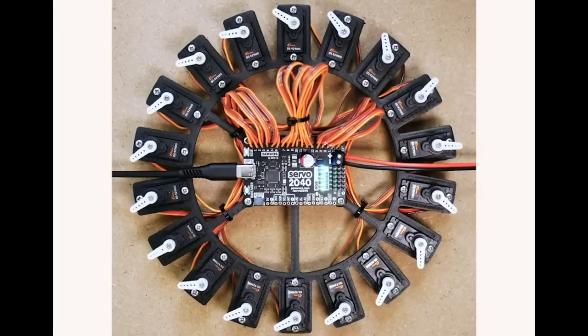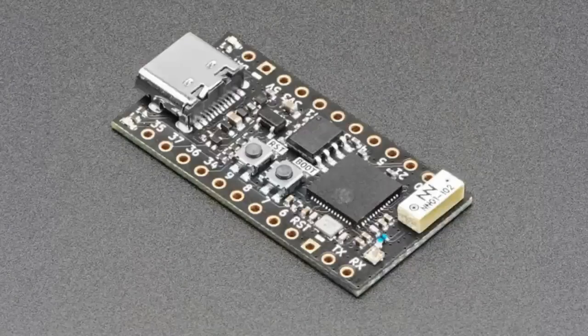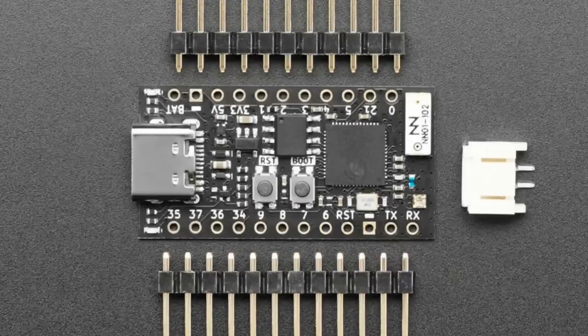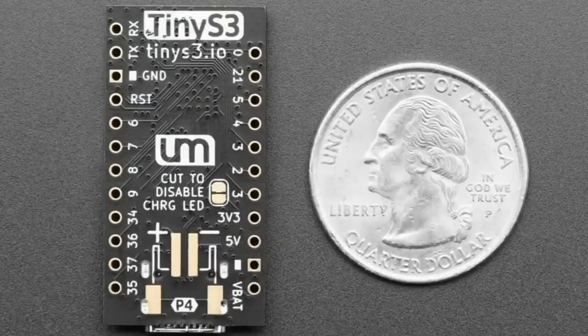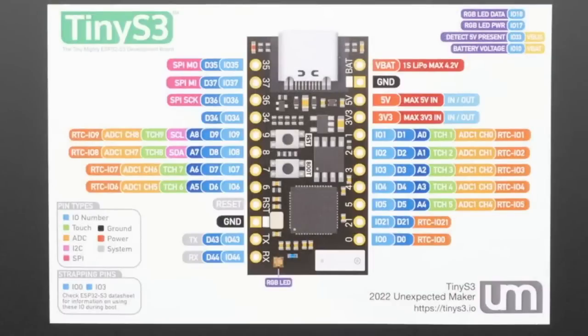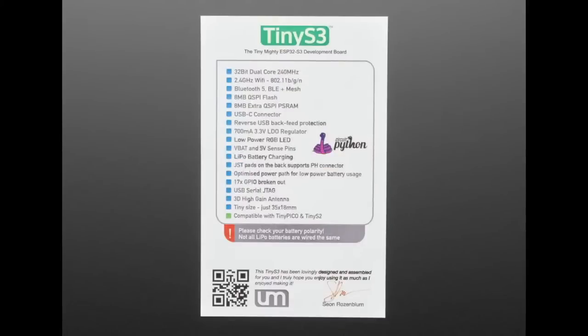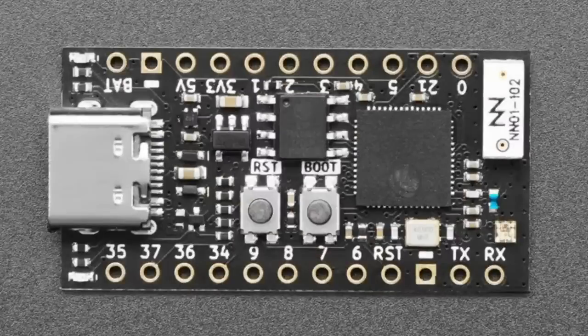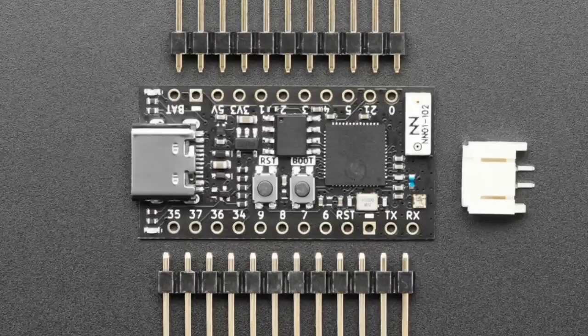Okay, and then starting the Unexpected Maker tour, here we go. Yes, we've got 3 ESP32-S3 boards from Unexpected Maker. This is, I think, the TinyPICO version, which I think has 8 megabytes of flash and 8 megabytes of PSRAM. All of these start with the USB native capable ESP32-S3, which is, as we mentioned, a dual core ESP32 board. So it's got Wi-Fi, BLE, 2 Tensilica cores running at 240 megahertz, 500K of SRAM, and then, of course, external PSRAM.